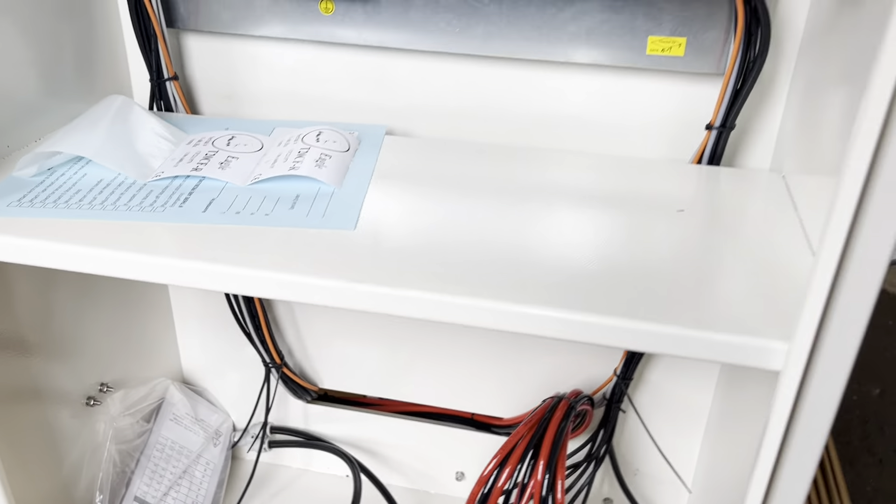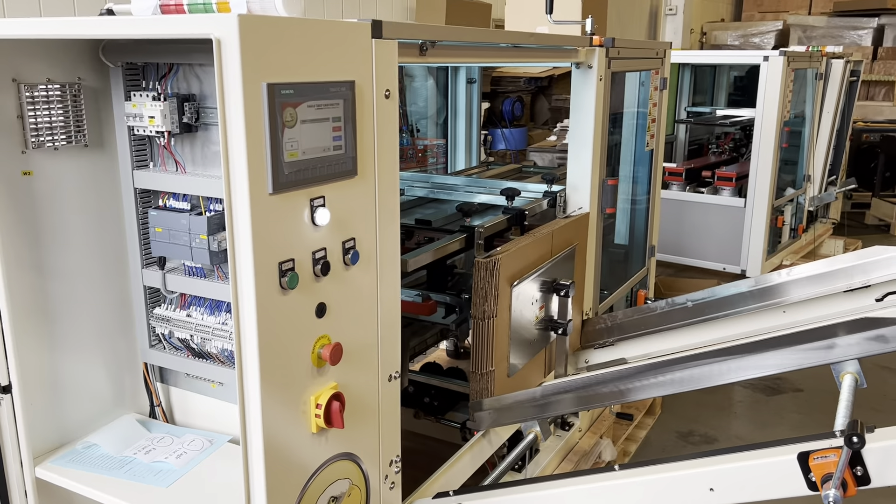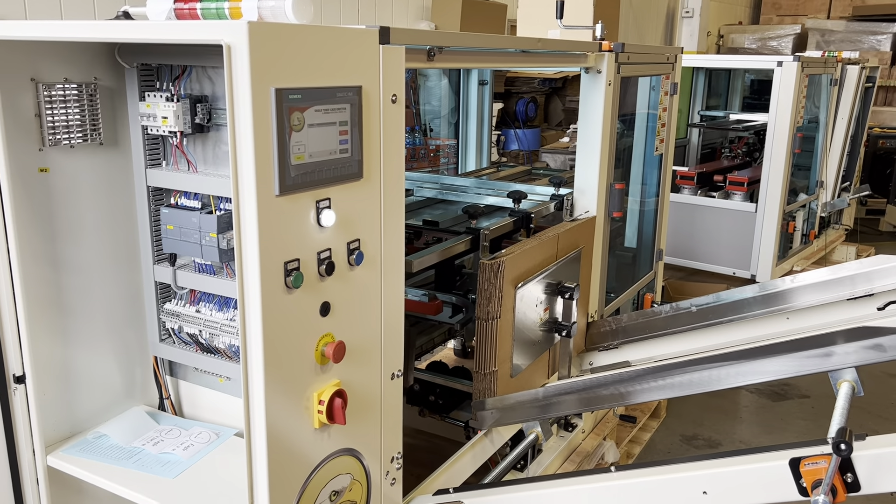There's a window down here to change the tape roll, makes it easy to access. Your other handles are down in the front here, a few up top. On the screen, you have a set quantity and an auto mode. You can go back and access parameters and machine settings where you can actually save six different cartons — saving all the handle values.